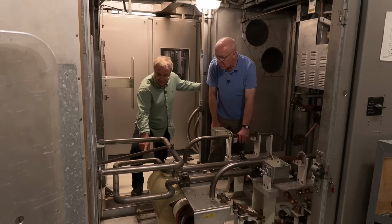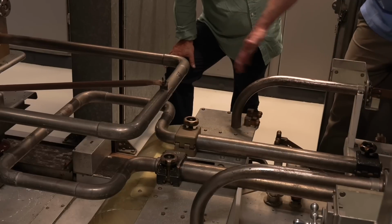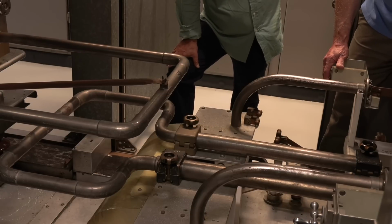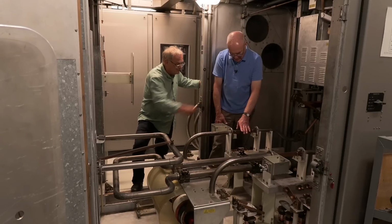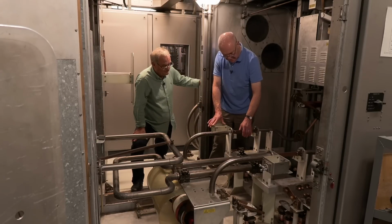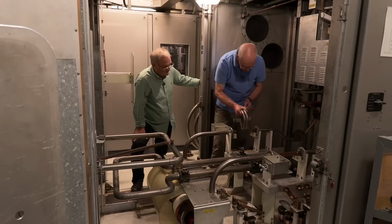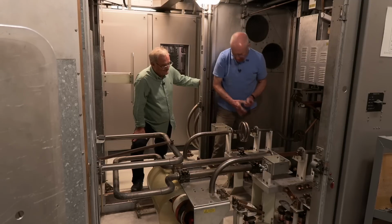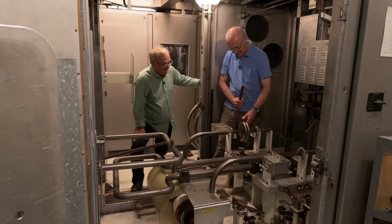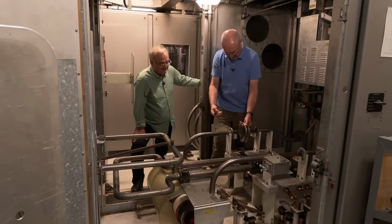So this is a coupling coil. Yeah, and the amount of coupling is affected by the truck's position, backwards or forwards, to what you want for 100 kilowatts, 200 kilowatts, 250 kilowatts, whatever you want. Okay, what's this here? This is just a link here on this frequency. But on 17 megs, the convention was to remove the link and pop in just a plug-in loading coil, just to get out to the 320 ohms. That is more of a plug-in coil. Yeah, this is 125 kilowatts down that side and 125 kilowatts down that side. Brilliant.